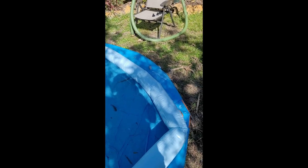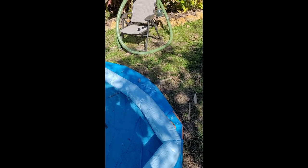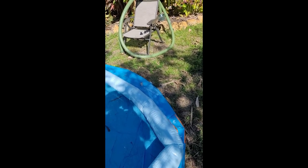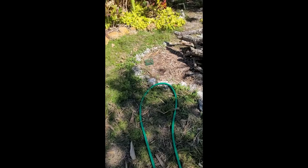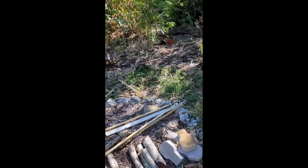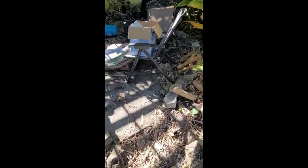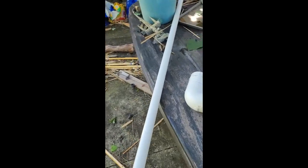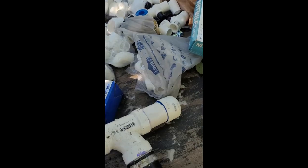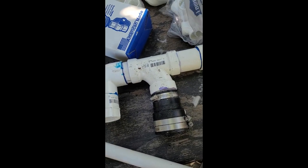Take your time. The pipe might stick a bit, and if it does, take off the drill head and try to back the pipe out a little, and then reconnect the drill head and start drilling again. I already told you about how we changed the drill head so that the hose comes straight down off of it, which I've got right here. But that's definitely, it helps a lot.